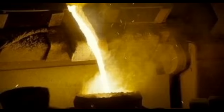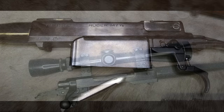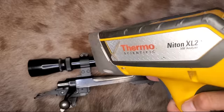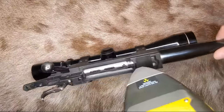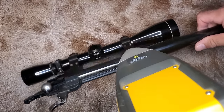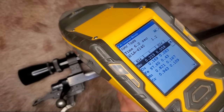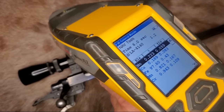The receiver and bolt of the M77 was completely made from cast steel. Cast steel is usually looked down upon in the firearm industry, but Ruger did it right. Testing this old M77 receiver verifies that these are made out of 4140 steel — chromoly steel — pretty standard chromoly steel. Of course, it's not forged, it's investment cast.